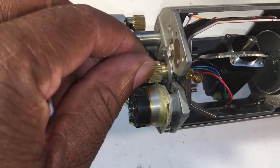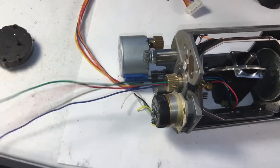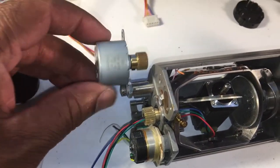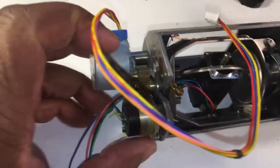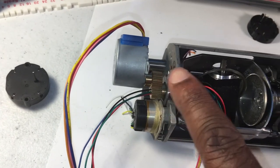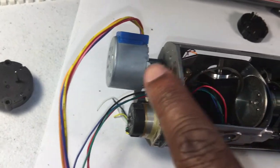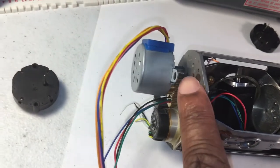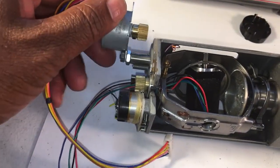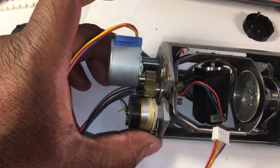That will tighten down the set screw. Our wires will exit out from this side, and I'll probably go with this stepper motor. I'll probably print a 3D leg and maybe pick up this hole here, or back-drill another hole and have a post come up to hold that screw, so that'll hold this motor in place.